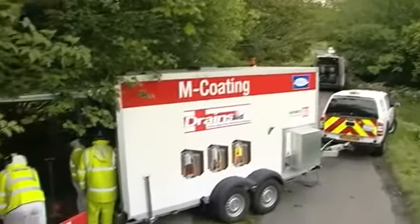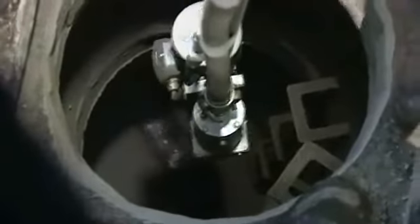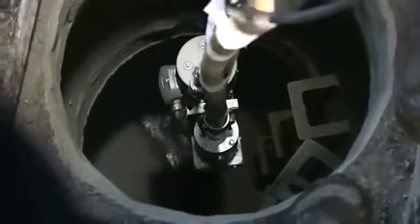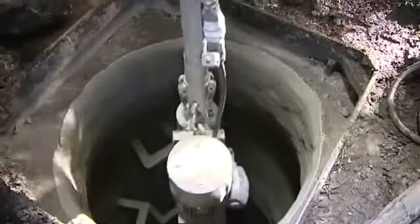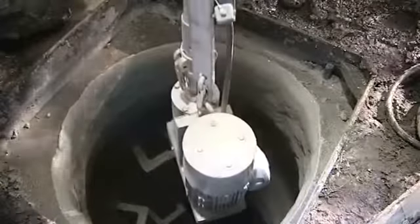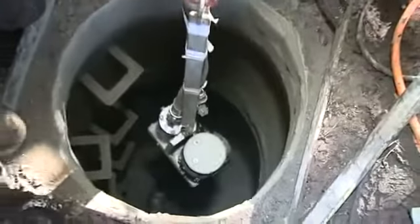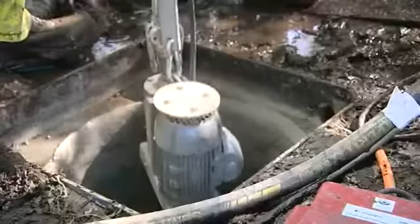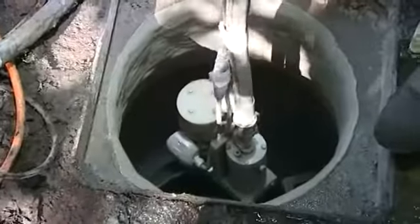For today's job, 38 separate passes will be required, each one adding a layer only 0.4 of a millimetre thick. After every 5 passes, the spray head will spin the opposite way to avoid shadowing building up on rungs or other protrusions. All in all, it's a precise and pretty clean process. There's no need for the team to block the channel, which can be kept in full flow whilst they carry out the work. Because each layer is so thin and delivered with such velocity, a level of compaction is achieved that could never be replicated by hand, or in this amount of time.